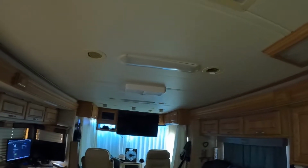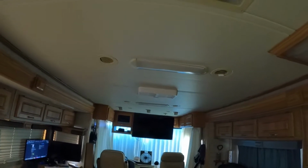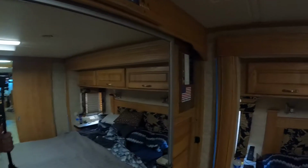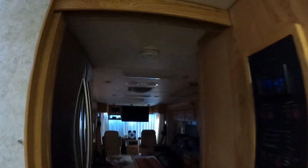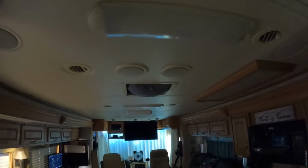So we are going to take some lights down, and I'm going to show you how to do it. But there's a fuse for it. All right, let's see here. Ceiling lights front, F5. 1, 2, 3, 4, 5. I'm just going to try to pull this sucker with my fingers. Safety first, never last. There you go, it's out. So let's go see if the lights went out. We successfully shut off power to these lights, because remember, this light was on.